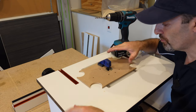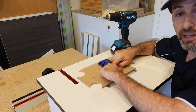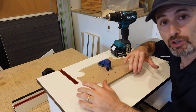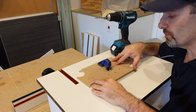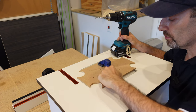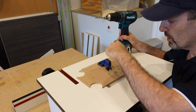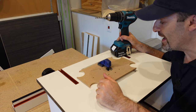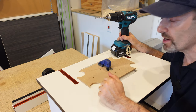Our next step here is: I've put that new template I just made — with the mounting holes and the center hole — and I've lined that up with the center hole of my mounting plate on my router table. I've just put a clamp through it to help keep it in place. Now with the same 5 mil drill bit that I drilled these holes with for the screws to thread on, I'm just going to drill into my mounting plate, and that will give me the holes to mount this router lifter on.